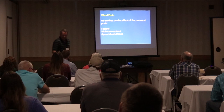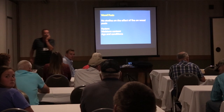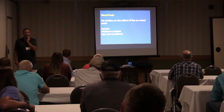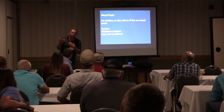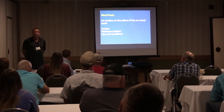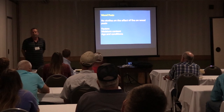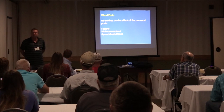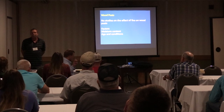Question: Have you looked at any effects of fire on high-tensile fences and fiberglass poles? Fiberglass loves fire — it'll just burn right up. We didn't look at high-tensile formally, but when I ran the research station we had about seven miles of old Gallagher high-tensile wire electric fence out there. We burned through it a lot and never had any kind of impact on it. It's galvanized — I don't know the exact standards since it was made in Australia — but I would imagine, as with most galvanized stuff, there's no kind of impact at all. But the fiberglass posts, yeah, they're not going to survive.